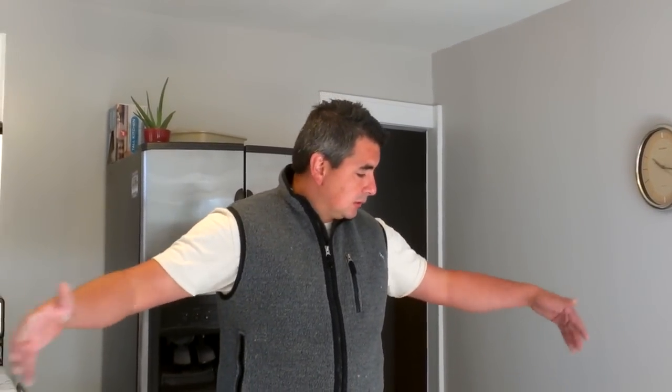A lot of people will say you want to split it in the middle, with a section on each side — and that's truly the right approach when you have small cut pieces that would be obvious in one spot. So if your entire room is going to be exposed, yes, you want to consider having equidistance between the walls. In this case, we have a lot of corners, cabinets, and appliances, so you want to make sure your full, nice tiles start in the most visible area.